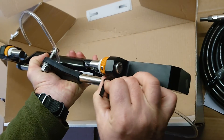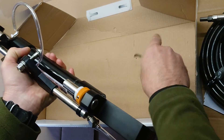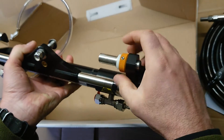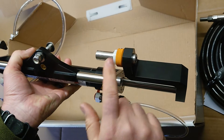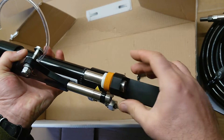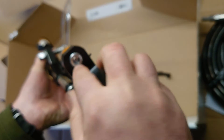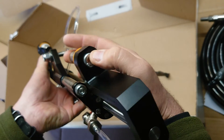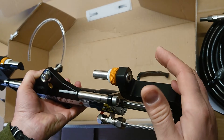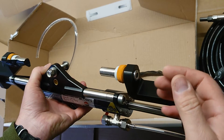It's a very smart system. You have very short pegs that fit inside the pipe, you have spacers, and this adjustable nut — same on the other side. They fit inside; put lots of grease in here and the ram just slides on top. All you need is some Allen keys. The beauty is you don't have that long shaft, so if you have a narrow well you don't have to take the engine off — that's going to save you time and money.